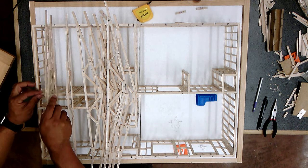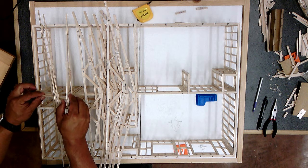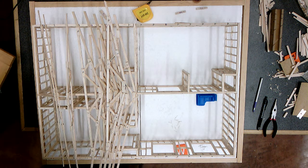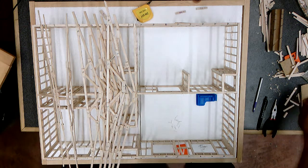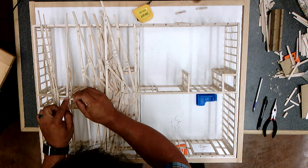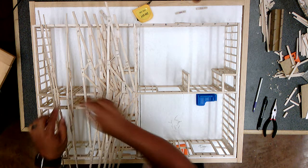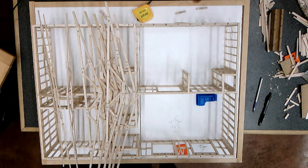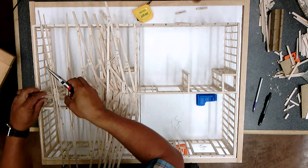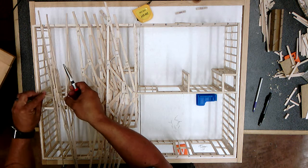So you don't have to nail these other ones in yet, but you have to go through this, and there's going to be a ridge block. And the ridge blocks look like, yeah, they're going to go right on top of the gusset. So be below the gusset when you're nailing this, and the nail may stick out. Try to make sure it's as vertical as possible.